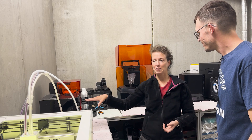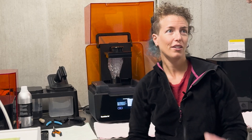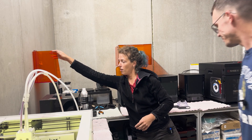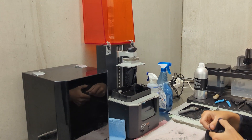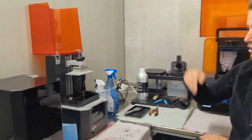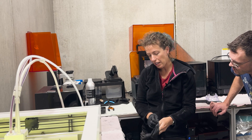The good thing about those printers is that the resolution is so much higher — you don't see all the little lines that the filament printer has. Can we take a look at these parts? They look like they're finished. Well, almost. The things are actually printed the other way around compared to a filament printer. The filament printer goes from bottom up, and this resin printer pulls the thing out of the tank from above. In this case, we have a carabiner here — it's not totally ready yet.